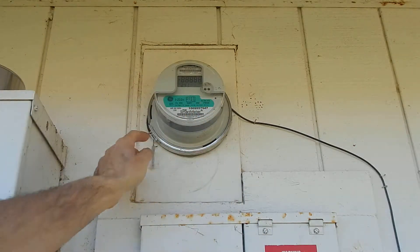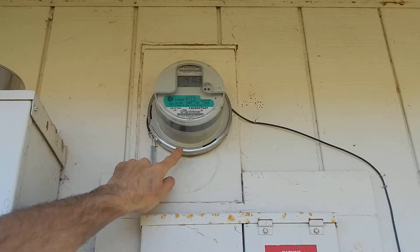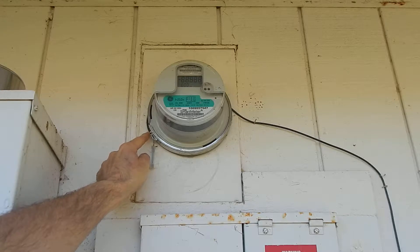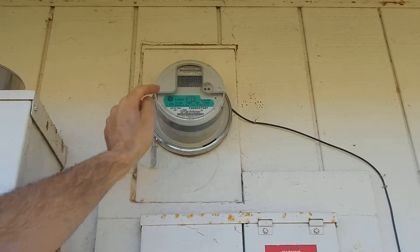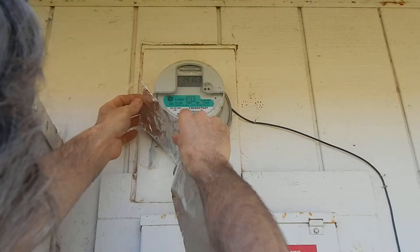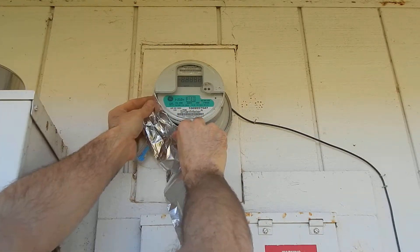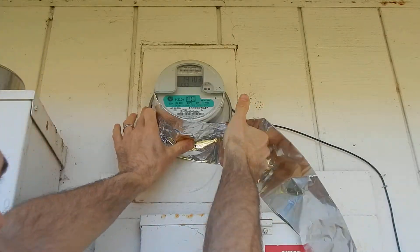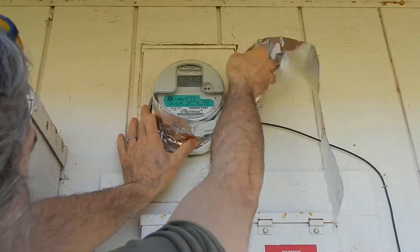Before I start that - I tested the ground on the ring and it was not grounded to the case, so I put a grounding wire. There's a little hole; I just ran the wire, twisted it, and then ran it all the way to a ground stake. Now the case is grounded and this foil will be grounded. It's really important to ground foil, for reasons I'll talk about in a second.